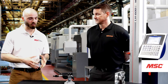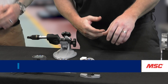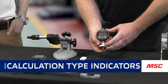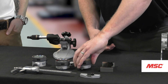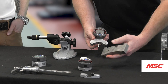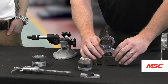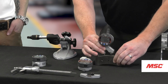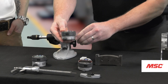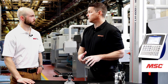We've got some really cool little hand tools here on the table, so where are we going to start? The first one we're going to start with is our calculation-type indicators. These already have nice little fixtures on them — this one here is for countersink depth. This one I like a lot; it's for radiuses and it already comes with this nice fixture. You can do inside dimensions like so, and then turn this piece around and do outside dimensions. These are all customizable, so if a customer wanted to come in with his own fixture, they can program that into the gauge.